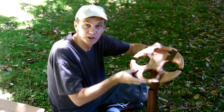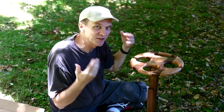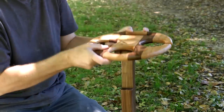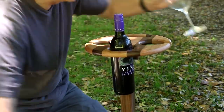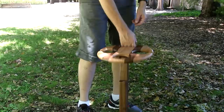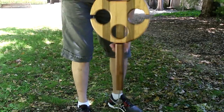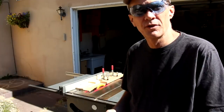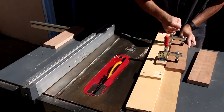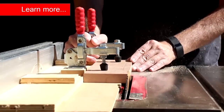A viewer of the show recently posted a picture of one of these on Facebook and asked if I could make one. It sticks into the ground and holds a bottle of wine and a glass on each side. The top is 12 inches or 30 centimeters in diameter. I'll edge-joint these three boards on my table saw and glue them together.